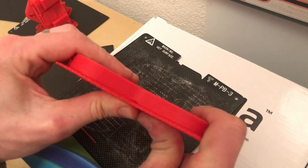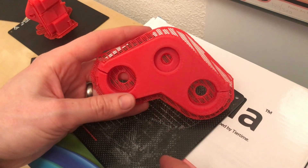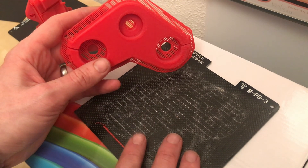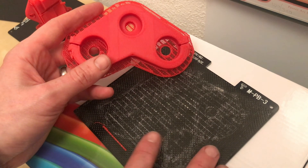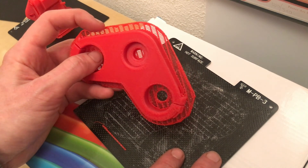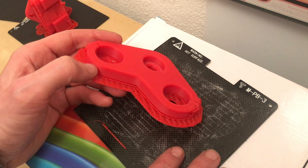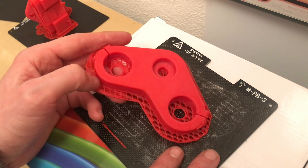I'm going to go back to basics with this new printer as I get used to using it. The next things to try are PVA glue, hairspray, and the ABS-dissolved-in-acetone mix — try all three of those and I'm sure we'll find the secret sauce for this particular printer. If you like these videos do subscribe and like the video, and if you've got any tips for how you get your ABS to stick — or indeed how you get it to stick with an UP Mini 2 — I would love to hear from you.